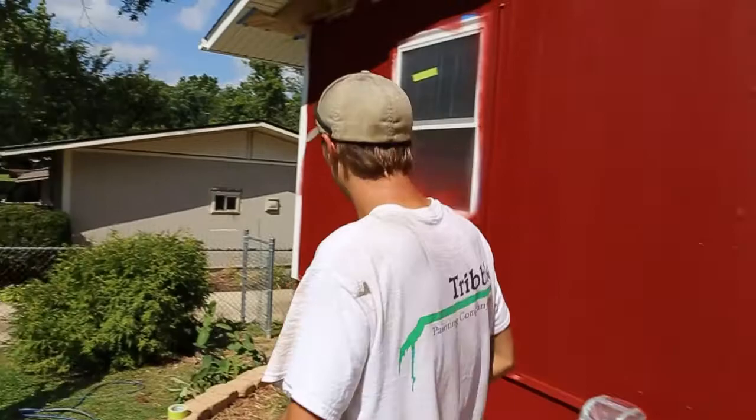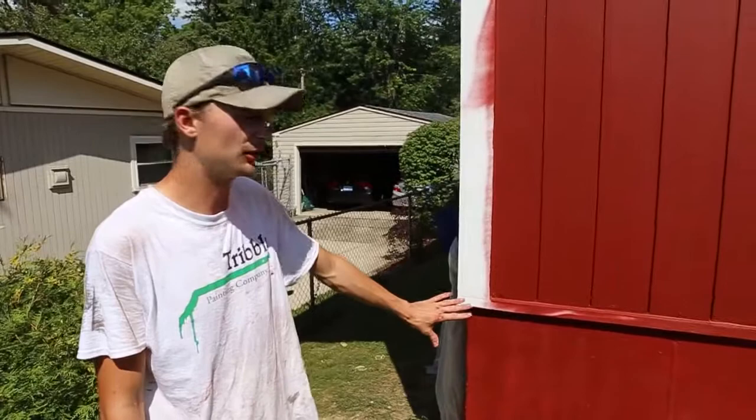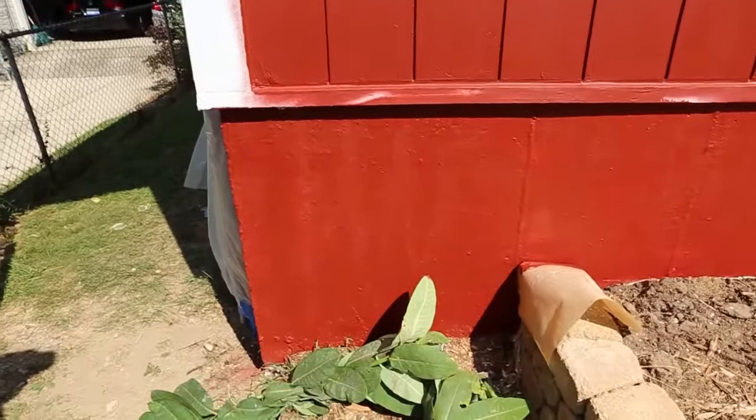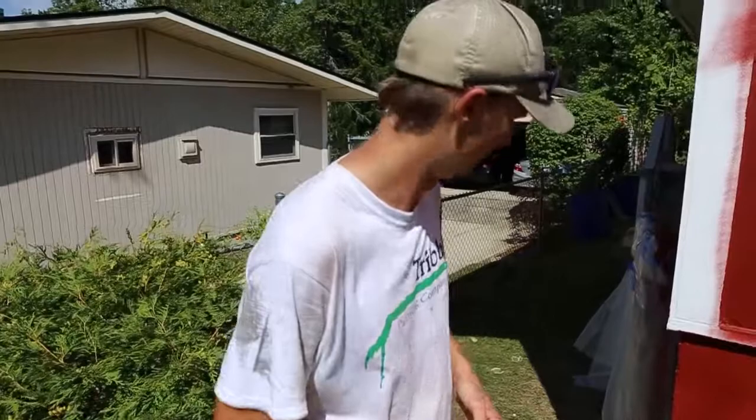If you want to follow me over here, we'll go take a look at that. There is one spot I want to point out as we're going around — the foundation here, we're actually painting that. You can kind of see right here, this has only got one coat on it currently and the coverage isn't really good. You'll actually experience that with a lot of reds, yellows, blues — anything with a deep base. One coat typically won't give you very good coverage, so it's typically a two-coater and possibly three or four, just depending on what color is underneath the new color you're putting on.